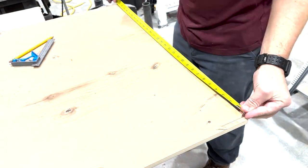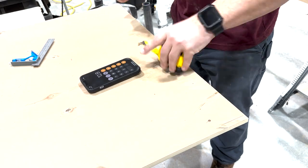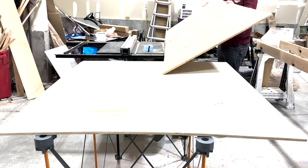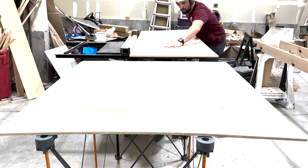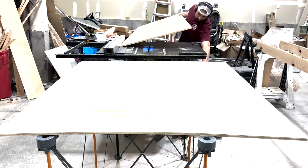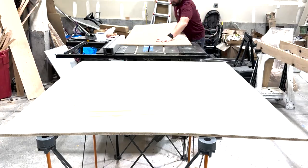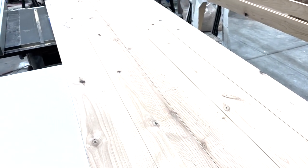The center panel for this door is going to have a faux slatted panel look. I'm going to achieve that by cutting tiny little grooves on the table saw. To ensure accurate spacing, be sure to account for how far the panel insets into the dados on either stile. To cut the grooves, simply raise your blade only about an eighth of an inch, run the board through, flip it over, do it on the other side, reset the fence, and do it again. Here's a look at what the panel looks like afterwards — it achieves a nice slatted look.